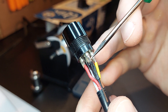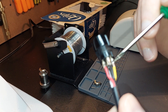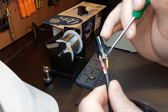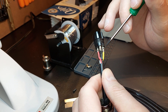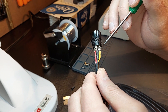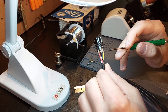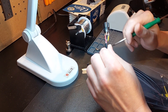All it takes is a little jarring. Remember, these cables are always in motion because your robot is always moving your spindle, and you're screwed. On top of that, we don't know if flux was used. I can't tell if flux was used here — these connections look a little glossy, but there's certainly not enough gloss to really dictate whether or not flux was used. Everybody can see just how little solder was used on here. These pins are supposed to be bubbled over and filled — that's the correct way to do it, as you've seen in my previous videos.